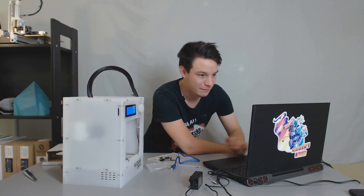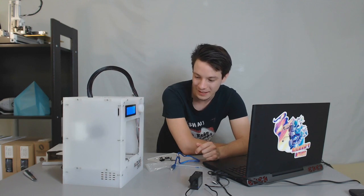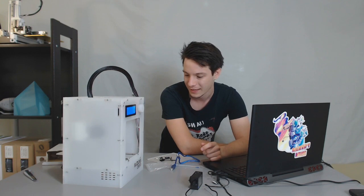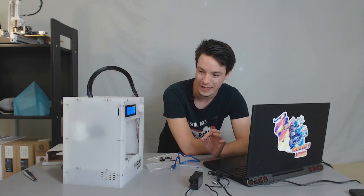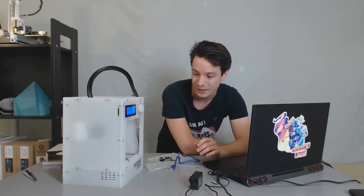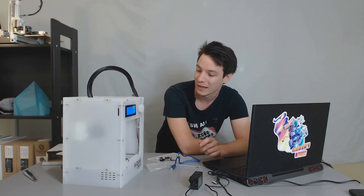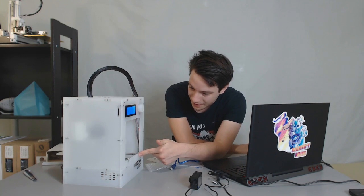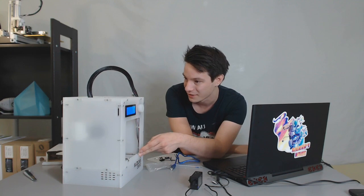Yeah, Vishal's saying I can see the Y rods popping in the front once the fit loses grip. Yeah, laser cutting isn't the most precise process. The tolerances do vary, and I can't really see them popping loose now they're in place, but I can see them having a high degree of failed panels, because if you put them in wrong, that's going to crack them, and if the panels are being cut on a laser that's slightly out of focus, they will be too loose. There's no glue on them by the looks of it, they're just sort of pushed in. Looks like they did originally think of having little mounts. There is holes for something, so maybe they'll go back to using that.